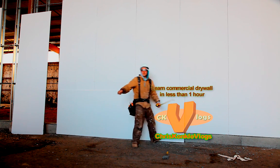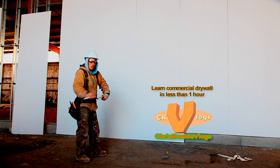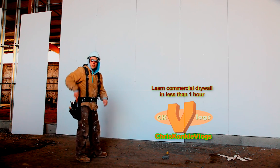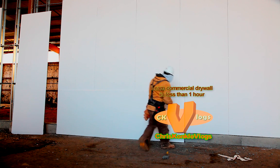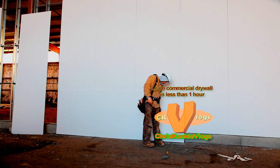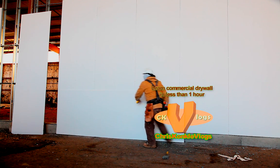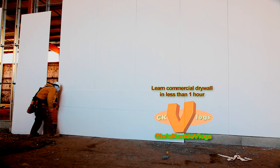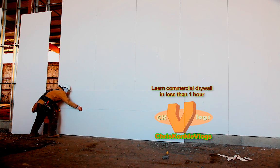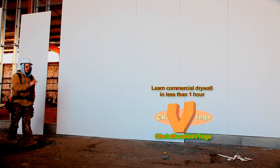You're probably wondering, how am I going to draw this line, right? I can't possibly just guess. So, take your knife. Just grab it a little bit, not too much. And what you're going to do, take your chalk line, hook it onto that, and pull and snap the line. Just like that. One at the bottom, 20 3/4 at the top.